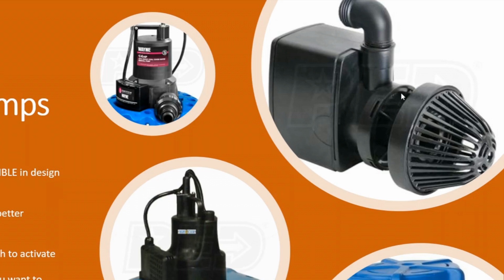So when you need it, throw it out there, plug it in, pump the water, unplug it when you're done, take it in. Don't let it run dry. It's not good for the pump, and it could definitely harm the pump and cause that pump to fail. That would not be a warranted failure.